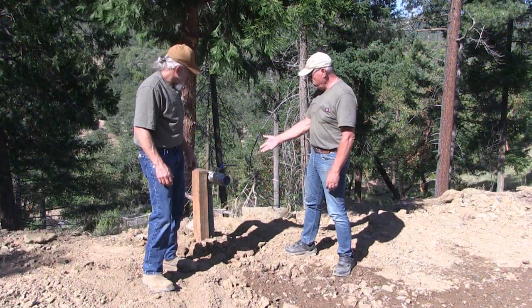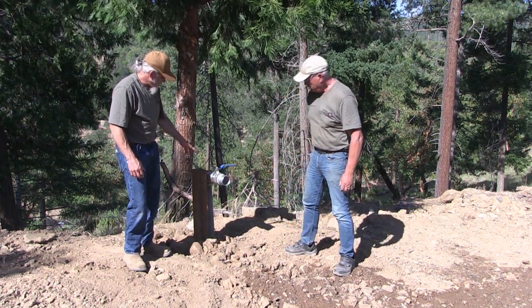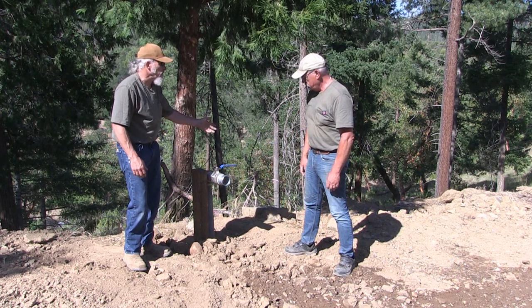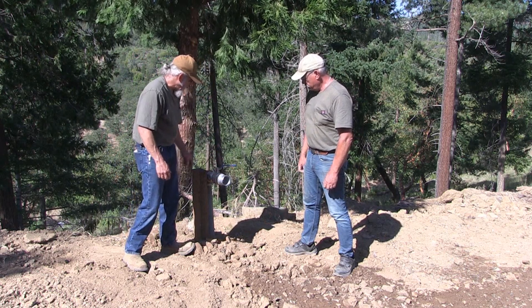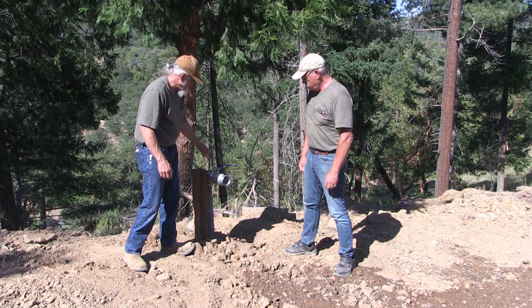So now we're down here at this hydrant. That was, what is this, a 3-inch? That's all 3-inch galvanized, and obviously you don't want plastic sticking above ground, because as soon as you have a fire, that'll melt and then you lose all your water, so that won't do you any good. But this stuff's getting really costly. Any kind of metal, anything, is insane. I mean, the valves, everything's gone up exponentially since we've had all this hyperinflation.